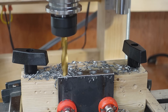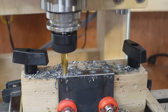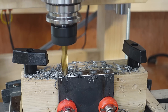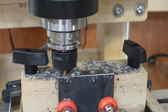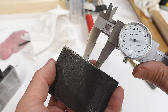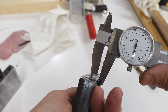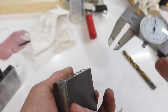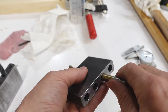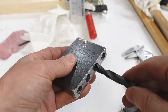It's drilling much faster but I'm not sure why it's chattering so much. That one broke through — excellent. Checking it over, the hole spacing is more consistent than last time. Lateral position is okay, though it does seem to decrease slightly as I go along one side — I can add a little shim to make up for that. The hole size is also more accurate: this is the drill I drilled it with and it fits in there quite snug, unlike last time where the hole was quite a bit bigger than the drill.